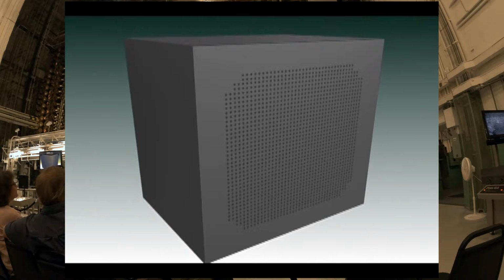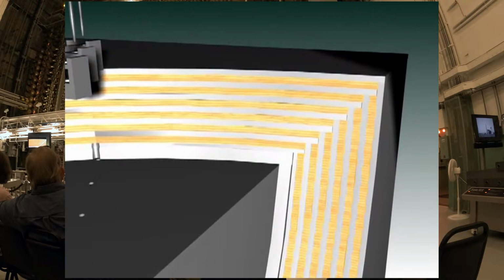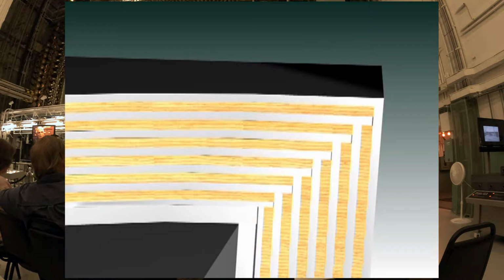These blocks absorb 97% of the gamma radiation emitted from the core. In addition, there is a biological shield that is outside of the core to protect workers in the area. Well, there's 52 inches of laminated steel and masonite. Then on the outside of that, there's a 1-inch thick boilerplate that encloses the whole thing, makes it gas tight.